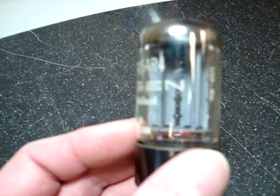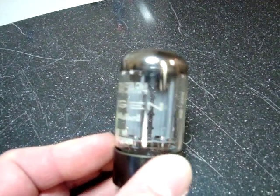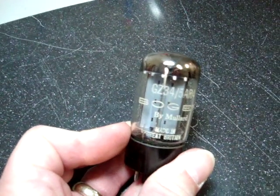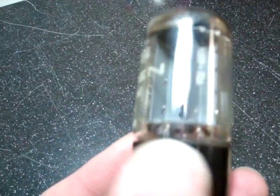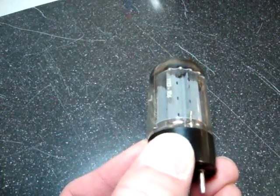I'll try and get you a closer image of that. The four notches can be seen in the edges of the plate. Frequently the labeling will say it was made by Mullard, and the date code again can be found around on the base, this one being a 1964 version.